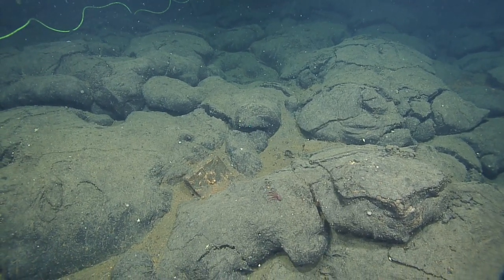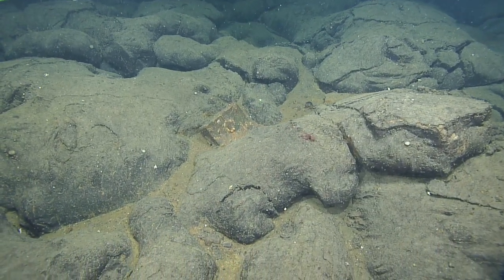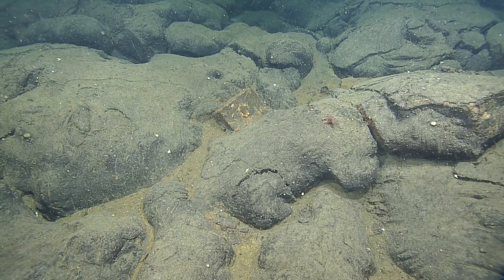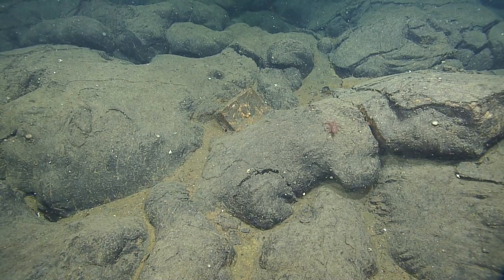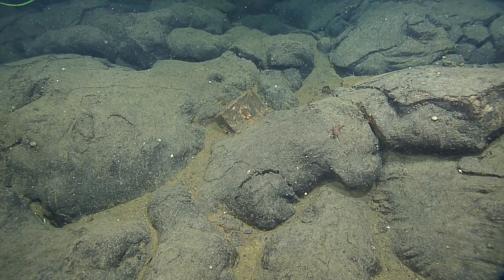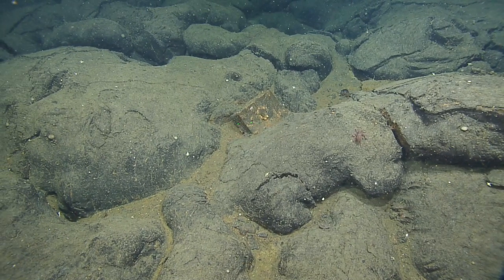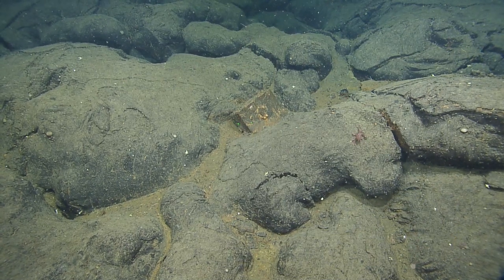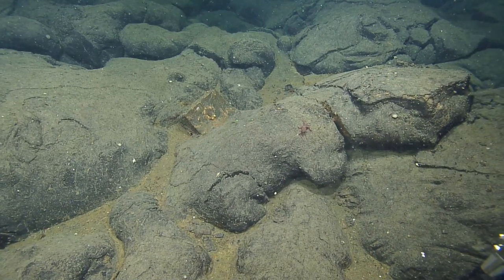If you gently set her down there, like under the lasers, but halfway between the lasers and the, yeah, anywhere actually. All right. Now on your left hand, push forward a little more and more, maybe 30%, 50%, and then you hit that button. That will lock the stick, and also hit that one, auto heading. Okay. So now the ROV is pinned to the seabed. And this controls the camera? Yeah, now you could go drink coffee or move your camera around and then ask video to zoom in.